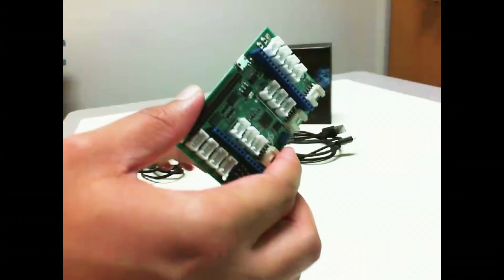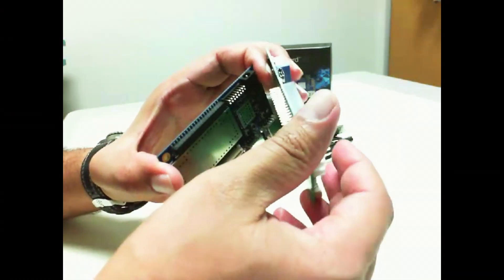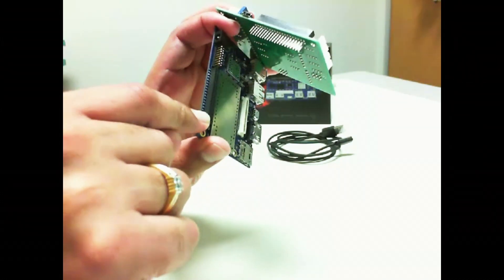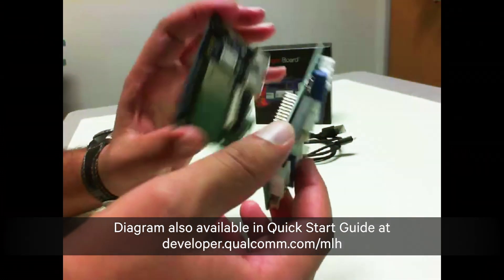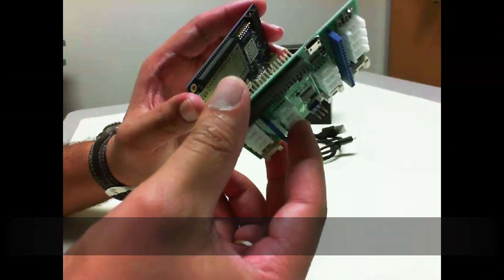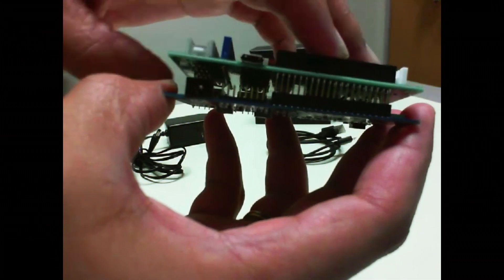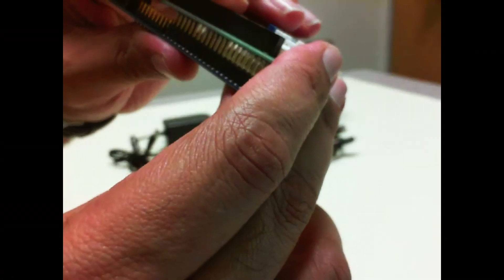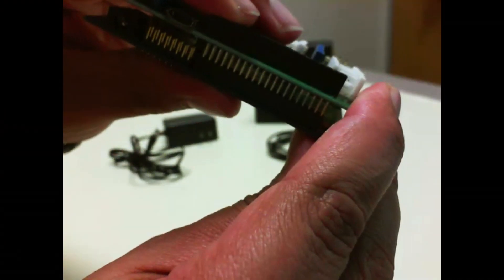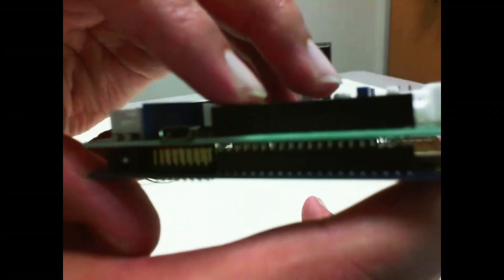For this purpose, we will get access to the DragonBoard through a UART line. Before actually powering on the DragonBoard, let's go ahead and plug in the sensors mezzanine. Please make sure that all the pins on the 40-pin low-speed expansion header are properly aligned before connecting the two boards.